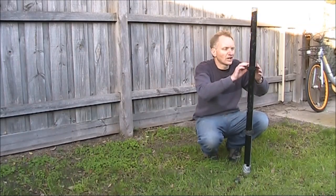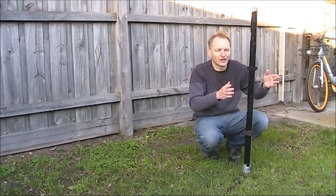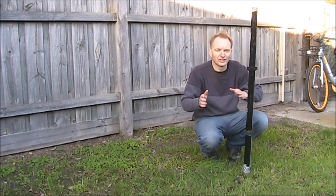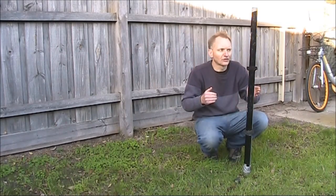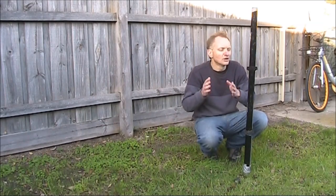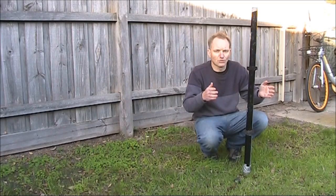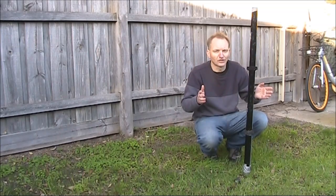At least that's the idea. I'll do a comparison on WSPR between this antenna when it's connected through the window capacitor and when it's connected straight. It won't be much of an antenna installation, but it will be the same installation in both test examples. That should give a reasonable idea of the losses through the window capacitor. I'll use a short counterpoise attached to the antenna coupler. I will transmit WSPR first with the antenna without the coupling capacitor — through the window or with a direct feed temporarily through the front door — and then switch over to the capacitor and see if there's any difference in signal reports received.